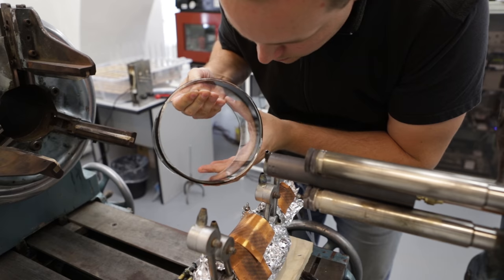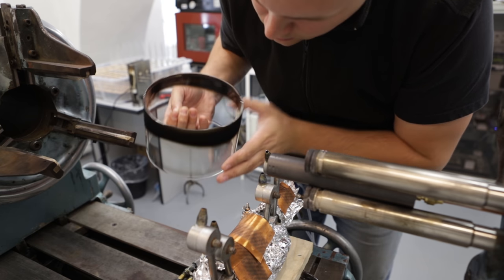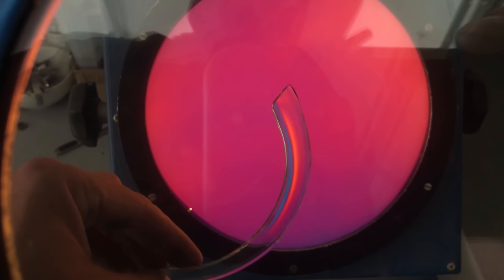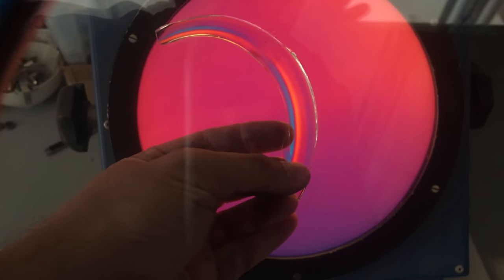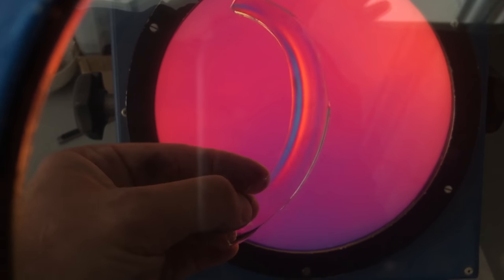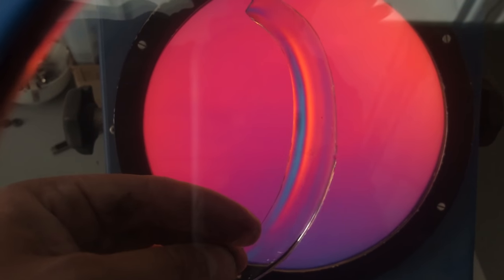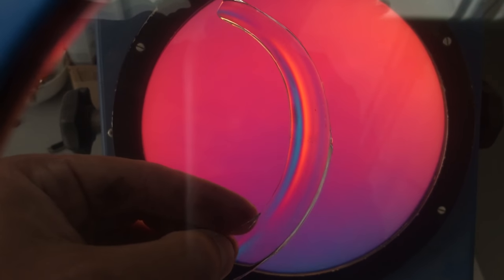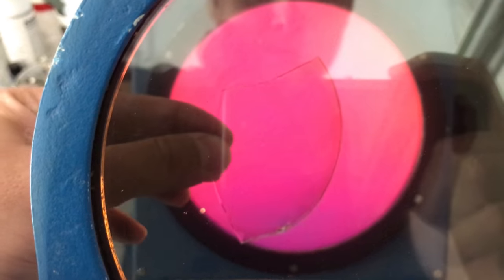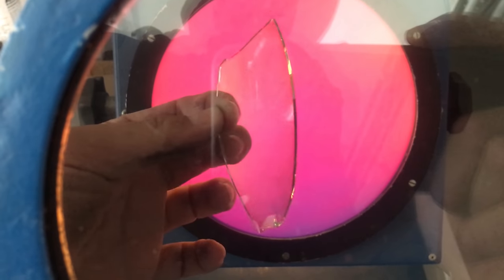I mentioned that I heated the glass only on the perimeter, and this caused a stress buildup along this perimeter. It's still visible here under the polariscope. The stress follows the perimeter line on the inner edge in the front window. So in the next attempt, I will try to flame anneal the front window after making the seal. The centerpiece is completely without stress.